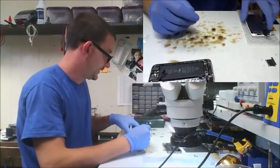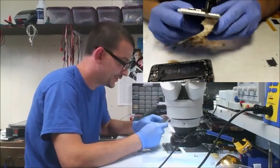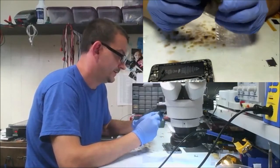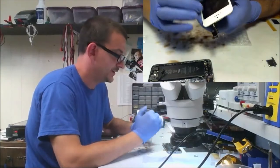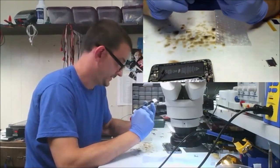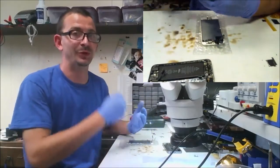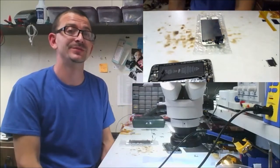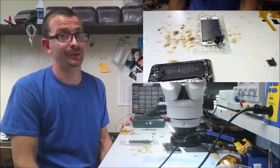Okay, so I have sat here and carefully selected all the screws for this display assembly, put them all back in place. Everybody looks happy. Clean the dust off the camera, make sure the lens is okay, clean all the fingerprints and goop off the front of the camera lens. It kills me when a phone comes here from another shop and it's got all this mess all over the inside of the glass where the camera is. It's like, dude, don't your customers ever gripe about that? Ours probably wouldn't either, but I nitpick.